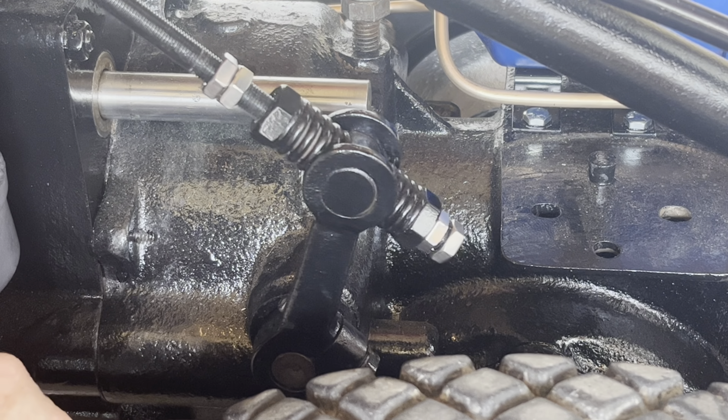That does cam over but there's absolutely no snap, so we'll need to tighten this. If the shift lever wouldn't cam all the way over, then we'd have to loosen it. But it cams over without snapping, so we need to tighten it — move it closer to the spring. Now it's starting to snap a little bit. I think that should be good. So we'll tighten the outboard jam nut up against it — take our two 9/16 wrenches and tighten these jam nuts right up against one another.